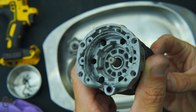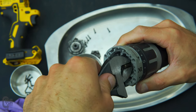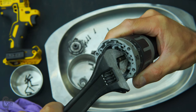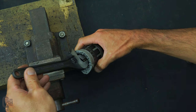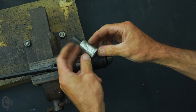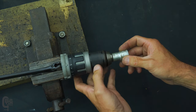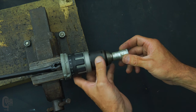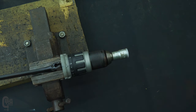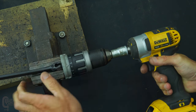This is the shaft that is connected directly to the chuck. From what I read and saw online, we need to grip this end of the shaft to be able to unscrew the chuck. The shaft has got two flats, so I decided to use a shifting spanner, tighten that up, and then grip the shifting spanner in a vise. Next up, I took a number 10 Allen socket, tightened that up in the chuck, and hit this thing with an impact wrench. I thought this might be the best method because an impact wrench is going to give it short hard hits to try and crack the thread loose. Supposedly this chuck has a normal right-handed thread, so turning it counterclockwise should loosen it from the shaft.